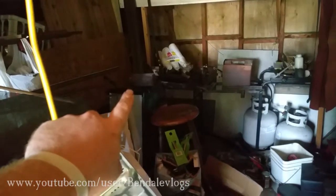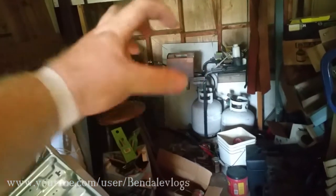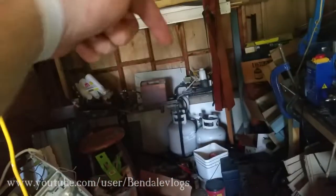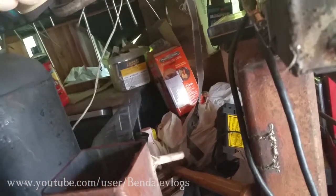The old one is here. I'm still going to use that one, but what I've done is taken and turned the forge. This hole on the top was facing forward, so I've turned it up. And this guy is going to drop in the top of the forge. It's going to rest on these hooks. I'm going to build a little grabber tool with two arms that come down and a handle in the middle, and I'll be able to grab those, hook for the back, fill it full of pop cans, melt some aluminum, because I have a shitload of pop cans.